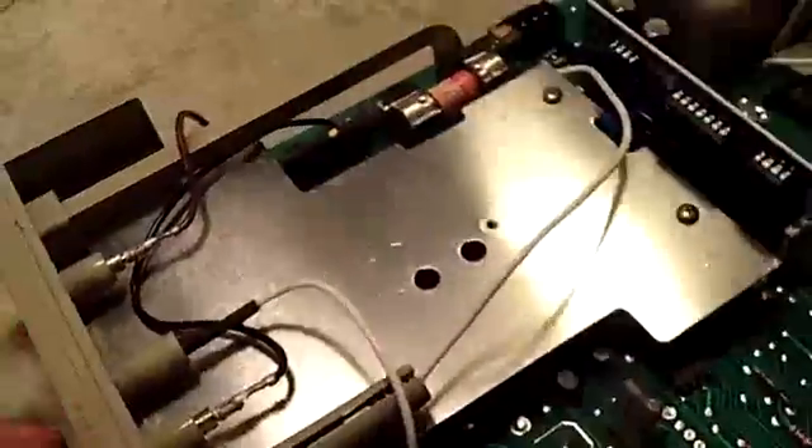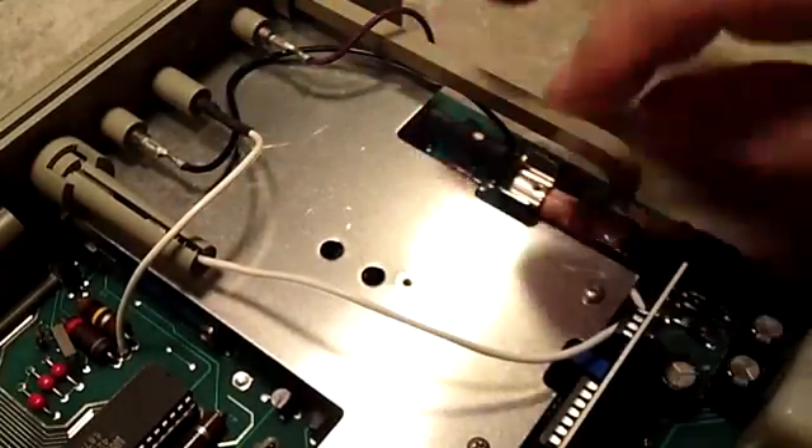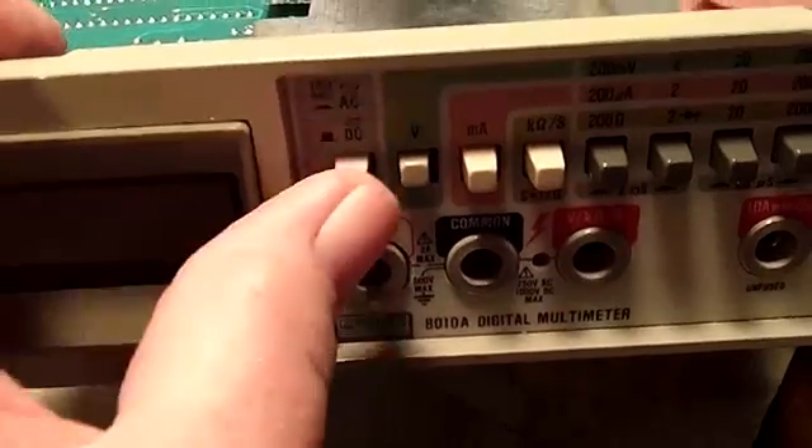I'm looking to take the access panel off to the switches. I don't see anything up front holding it on, but you can see all the switches in there. I thought we'd go ahead and take a look at this — I'm hoping just some DeoxIT and cleaning will make these things perform like they should. The AC/DC switch doesn't function correctly — I push it in and it doesn't stay, it just pops right back out.